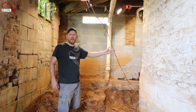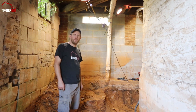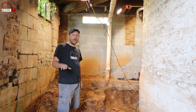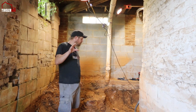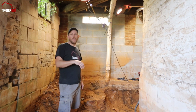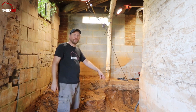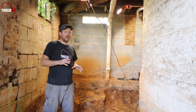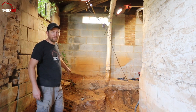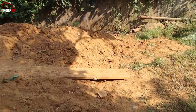We still have to finish all the way to the back corner, but everything else is lowered. We're probably even lower than we have to be, which is nice because now we can actually level it all nicely and put gravel on top before we put the concrete in. Over the next couple of weeks, hopefully we get the French drain dug out and finished all the way down to the hillside. They're going to come next week again for some more trench digging for the pipes.